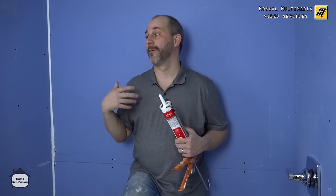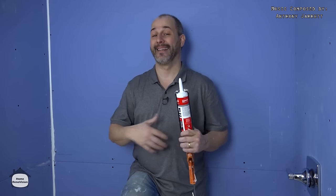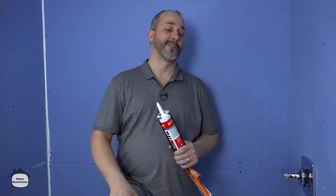Where I'm from, we're allowed to use drywall and adhesive and stick tile on the wall and call it done, and I think it's embarrassing. Now, they've recently changed that. At least they want you to use a water-resistant drywall, but that's just garbage that's going to last a few years longer. We have a lot of showers that are going 5 to 10 years and then they're failing. The problem is they're in brand new homes with really nice materials and great finishes. People are having ceilings getting all water stained, walls where the paint's peeling down, and mold issues related to showers that aren't even 10 years old. It's got to stop, and here's how you do it.